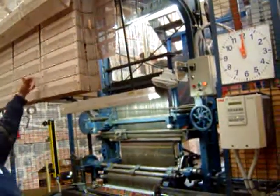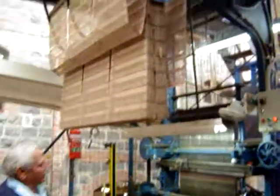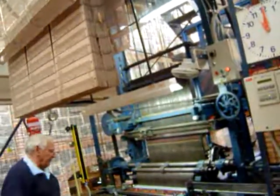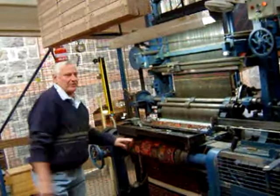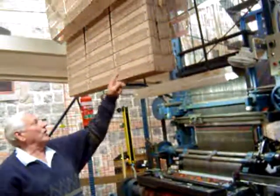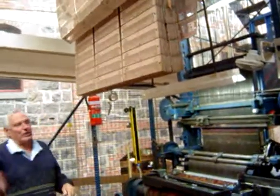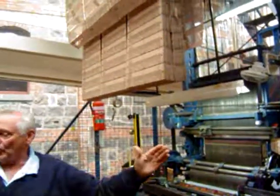Now, I'm operating on numbered rows, 38, 39, 40, and so on. Nothing metric about this old loom. 27 inches wide. Narrow loom carpet is 27 inches wide, therefore 9 inches, 9 inches, 9 inches. Three cards gives me one row 27 inches wide, okay?